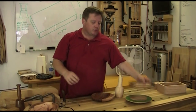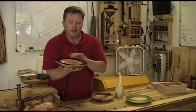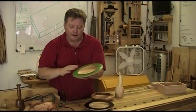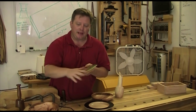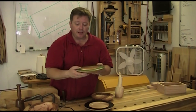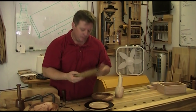Some other things I did on some dried wood — this is some maple. I did some pyrography on the back; the edge of this thing is actually burned. And I did that slack finish. This one has got some milk paint on it and I am really liking milk paint. Strangely, the milk paint is smoother than the wood. You can sand the milk paint up to a much higher grit, and then when you put wax on it, it just smooths it right out. A lot of people think that milk paint is going to be rough, kind of that crinkled look, but no — you can make a really nice finish. It just takes a little time and sanding.